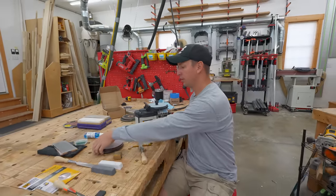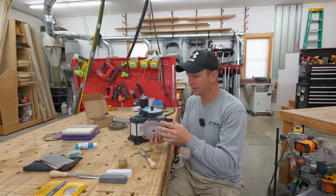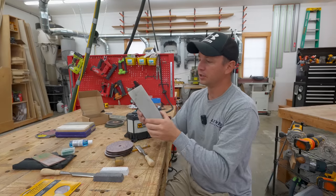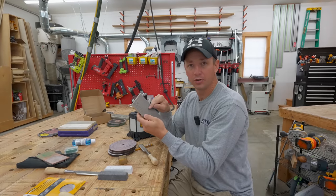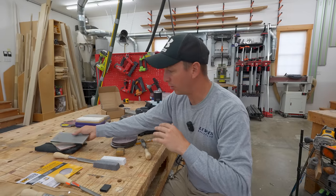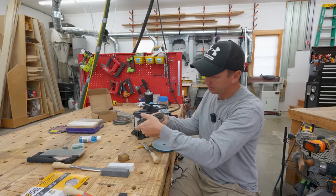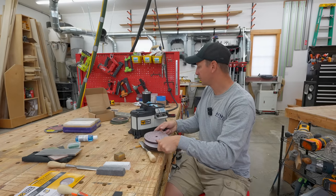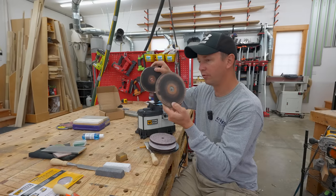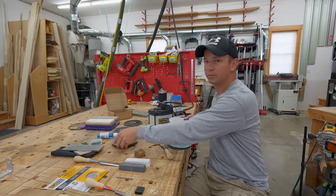When this unit comes with the kit, it's got two glass wheels. To do a proper job sharpening a chisel, you need to go through the grits gradually. That's one of the reasons I found the diamond stone just didn't work very well - it goes from 300 grit to 1000 grit, and that's just not enough steps to really polish those marks out - it's too big of a jump. So I've basically got 120 on here and then four discs: a 220, a 400, a 1000, and then I've also got two leather strops - one with a heavier cutting compound and one with a very fine polishing compound. It seems like a lot of steps, but that's really what it takes to sharpen chisels or plane irons well.